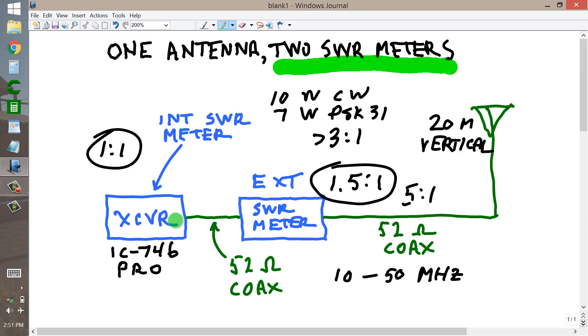That's why I have two meters. I want to know what the real SWR is — the true SWR on this line. Primarily because it will detect when something's gone wrong with the antenna: a short, a break, something fallen against it, or maybe I've failed to extend its telescoping sections. The transceiver will not indicate such a malfunction — as long as it gets what appears to be a perfect match, the malfunction could very well exist. On 20 meters it would not read 1.5 to 1, and I'd never know it. That's why the external meter.